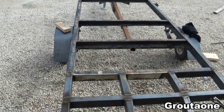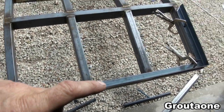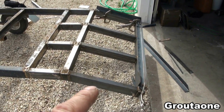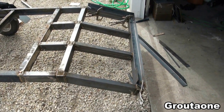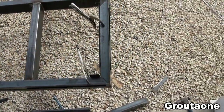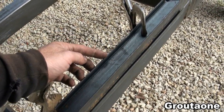I want to build a swing-out ramp for this end of the trailer. I've already got two pieces of angle clamped here, and I'd like to use this end of the trailer as a jig for welding the swing-out part together — but I don't want to weld the swing-out part to the trailer. So I've created a bit of a gap using some spacers, with some angle here and also here.